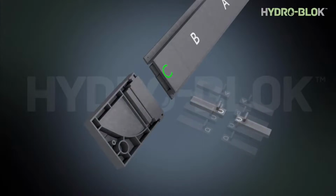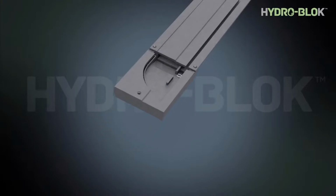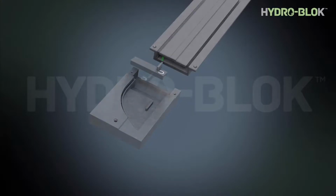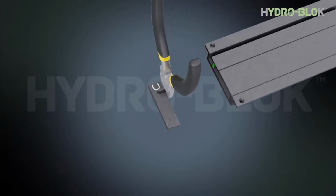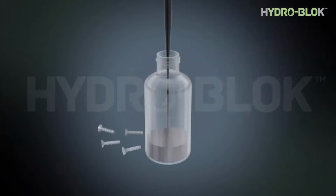Select the matching ramps using the zones marked on the underside of the drain body. Align tab on ramp with tab on end cap. Test fit the end cap's assembly into the drain body. If the ramp tab interferes with the internal drain body supports, trim the ramp tabs as necessary.